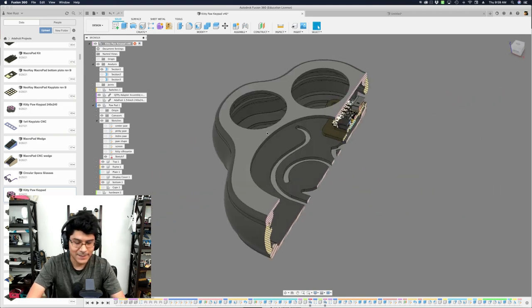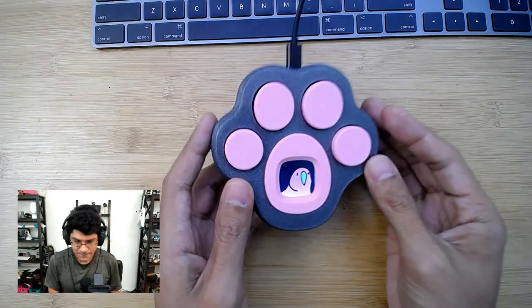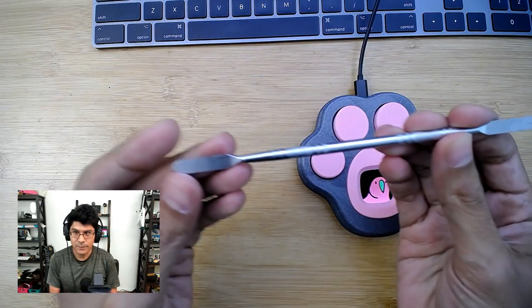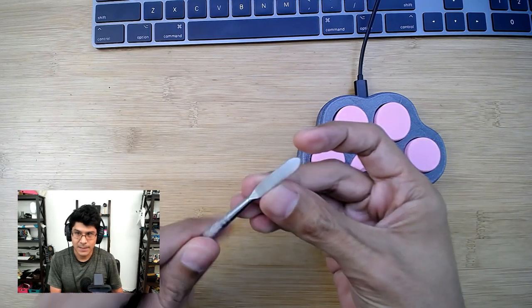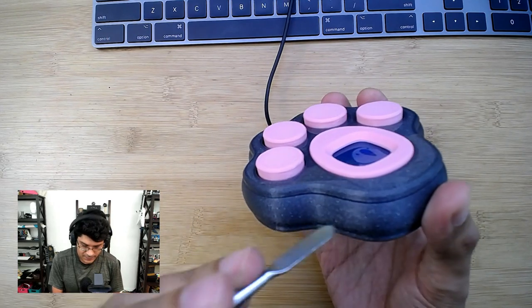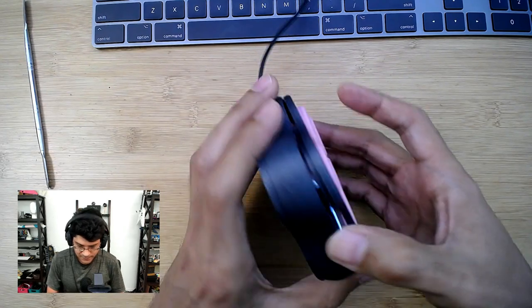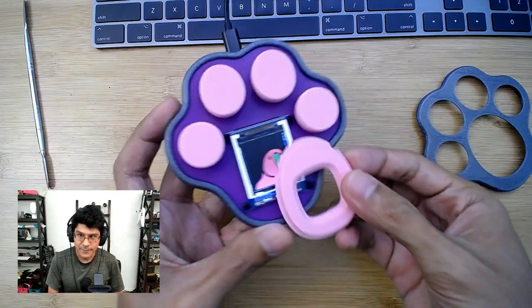So with that out of the way, let me go back over to the overhead and show you opening this thing up. I have a spudger tool. You're like, what's a spudger tool? It's a tool designed to be super thin on this edge and this edge here, so you can pry things open. So you can start to see where my thing would be. And this is where you get your spudger tool in, and you just pop it out like that. And then the rest of it can pop out pretty easy with your hands. This just kind of floats in there.